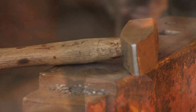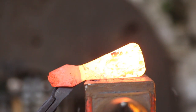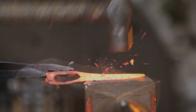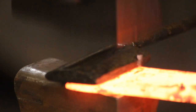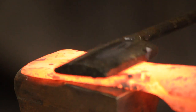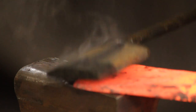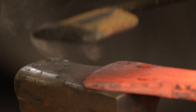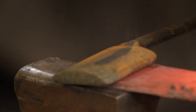If I wanted to make a normal axe rather than a hatchet, I would use slightly bigger, slightly thicker material. Just dress it for squareness every now and then — make sure it's straight. You're basically roughing it out on the anvil, and then I tend to head over to the power hammer and use a round back flatter. You could use a regular flatter whether you've got a striker or you're on your own, or just use a wide faced hammer to take out all the cross peen marks. The power hammer is a lot quicker and easier — saves time, and time is money.